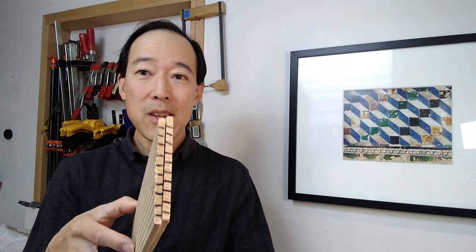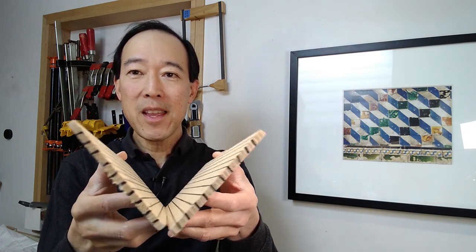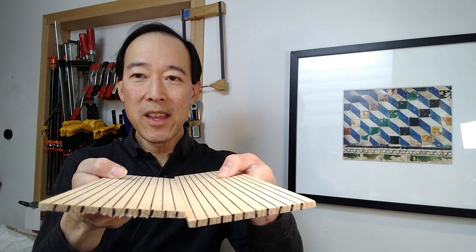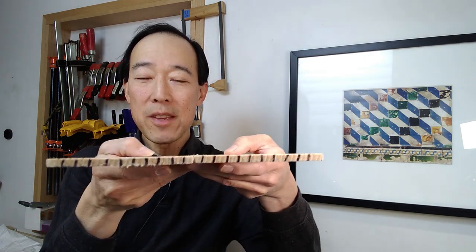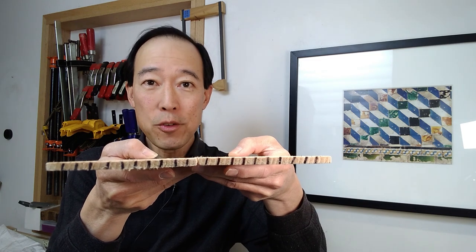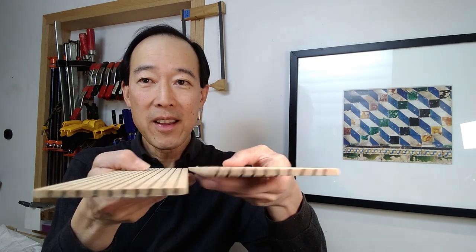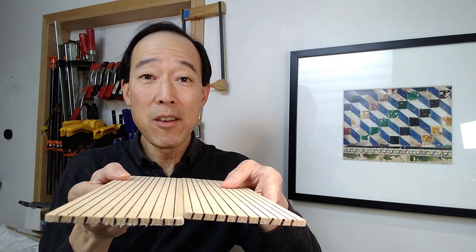The result with a sister set of adjacent slices is like bread coming off of the loaf. If you splay them in the middle, they will be bookmatched, and if you look at it end on, they will have vertical grain — exactly what you want for guitar building for maximum stability. You want these lines to be perfectly vertical, and they'll have the lowest amount of expansion or contraction with changes in humidity, making them very resistant to cracking.